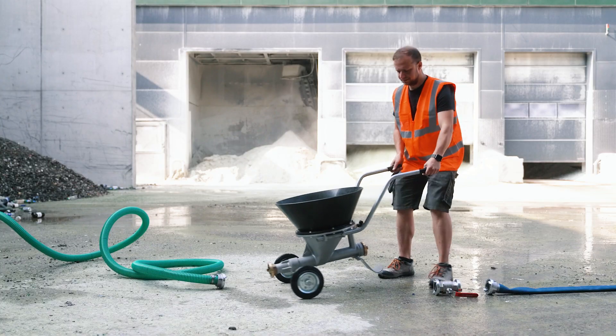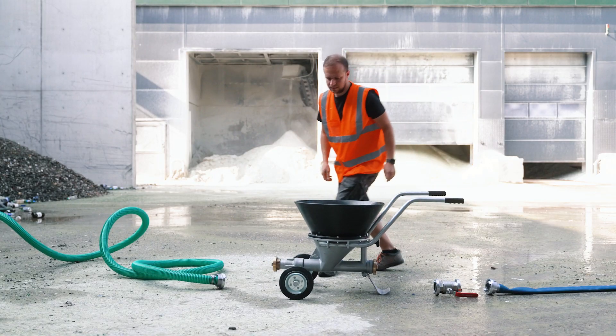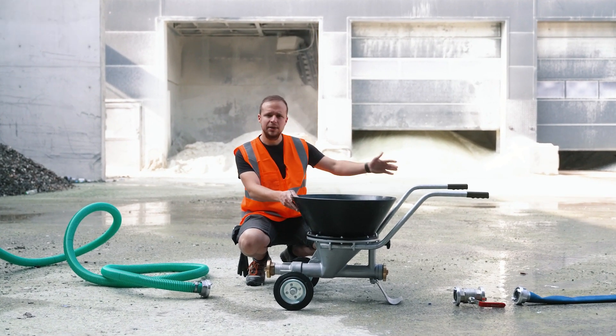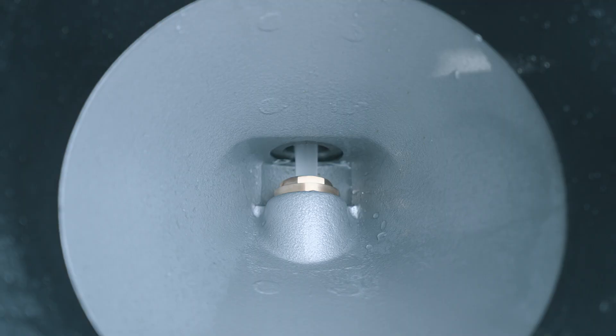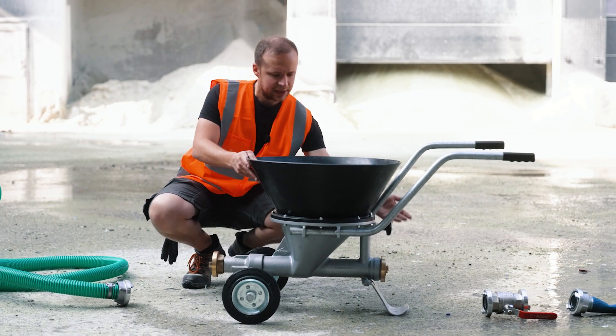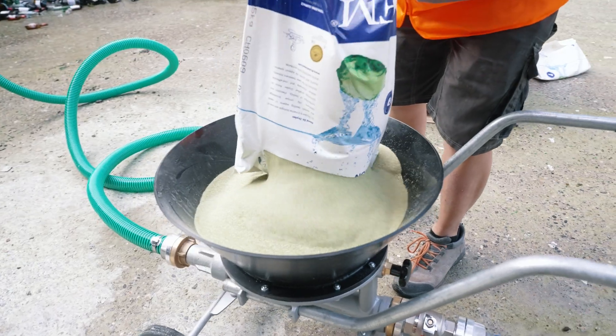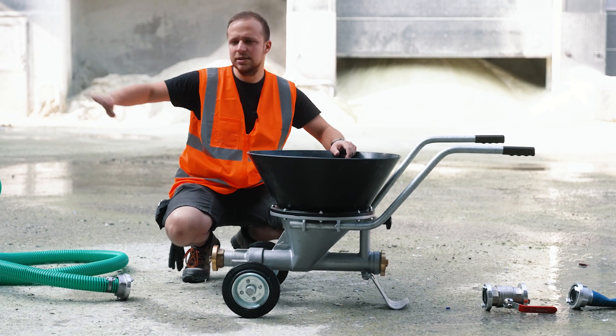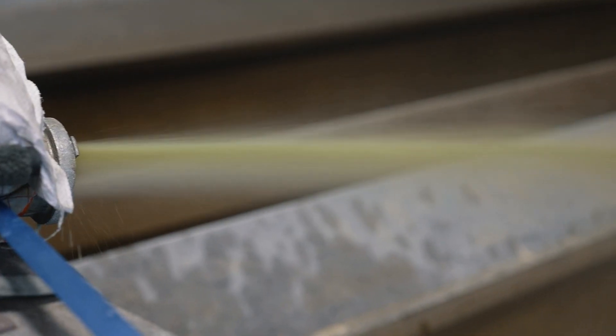Hi, I'm Jonny from Dryden Aqua and today I'm going to present you the liquid jet solid ejector. So how does it work? It's pretty simple — we need water from the mains with some kind of pressure that we connect here, then we feed in the AFM, this is accelerated and mixed with water, and then we transport it with a hose directly into a filter without any dust or any special equipment.